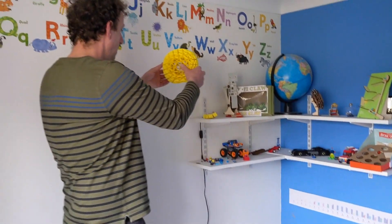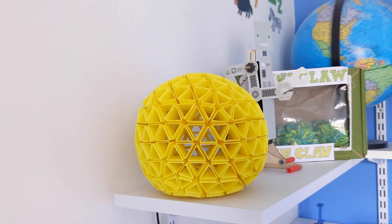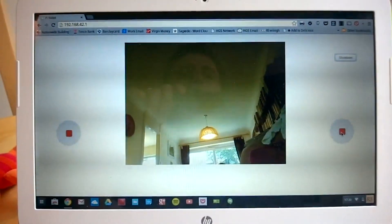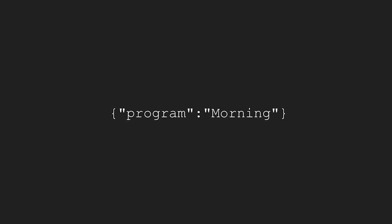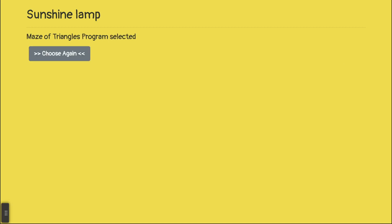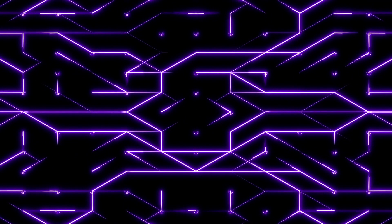To get these programs to run remotely, I first considered whether I could have the Pi broadcast its own WiFi network for a device to join and then somehow control the lamp. In the end, I wrote a Program Selector Python script which checks a JSON file on my site to see if the program status has changed. A super simple web form sets the program by passing its name to the JSON file through a URL and a PHP script. Finally, I used the crontab file on the Pi to schedule the Program Selector script to run once a minute, which felt a bit strange — it seemed odd to think about a lamp checking my site over a thousand times a day.